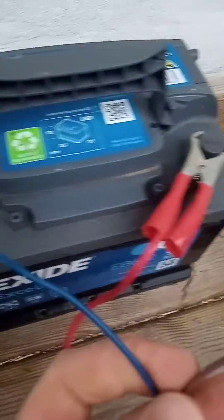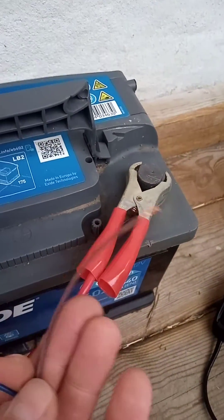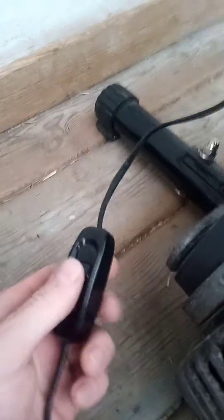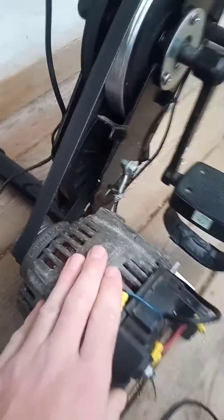This cable runs up the bike through a power meter, then down through a switch, and then it terminates at your battery — negative and positive. You can use crocodile clips or whatever to connect it. The way it works is you get your bike going, start pedaling, get it up to speed, and then you switch it on. That will then excite the coil and the alternator will start working.